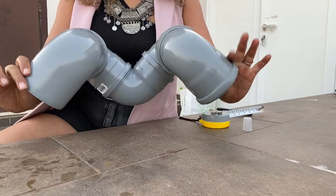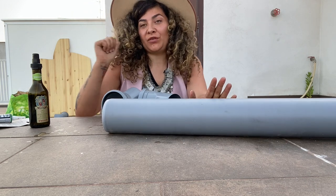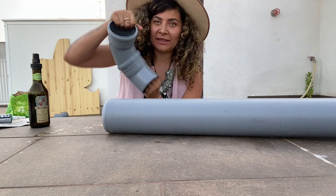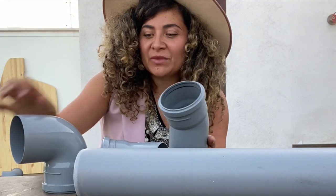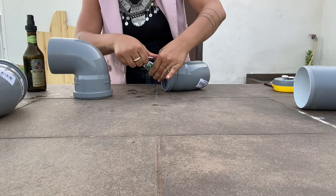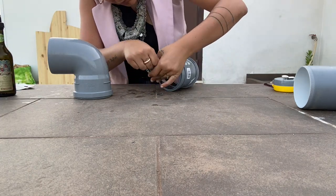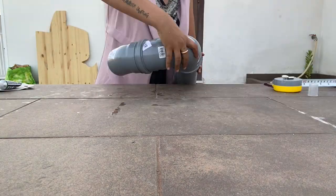This is where your arm is gonna go. Top part! The back of your chair is gonna be composed by two diagonal ones, so not the complete L curve. Not this one, but more diagonal. So two of this one, one of this one, and the long leg on the back that we're gonna have to cut at the end. Same identical thing also for this segment. You put your glue, you put your oil to slip it inside, and you are done.